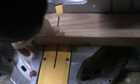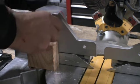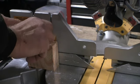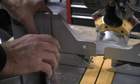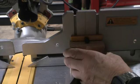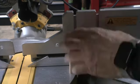The slightest little deviation on either side, it's going to give you some trouble making those cuts really clean. So it's important to set them exactly. Then hang on to that block. It's a reference gauge, so you can reset it if you need to change from crown stop to cutting other material. Notice that it fits snugly on both sides, and that's critical to using this stop properly.